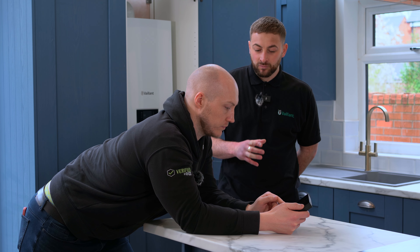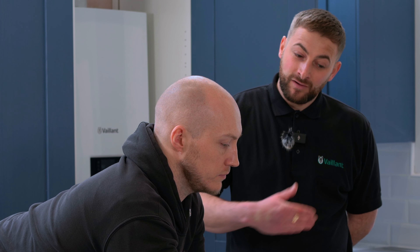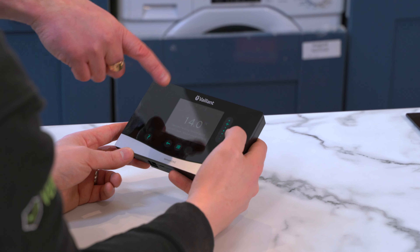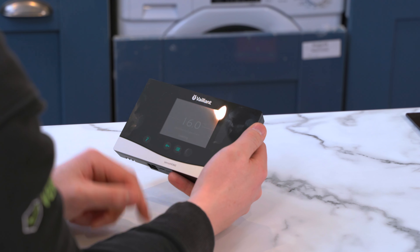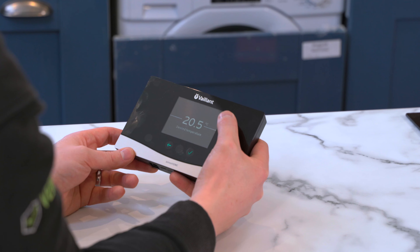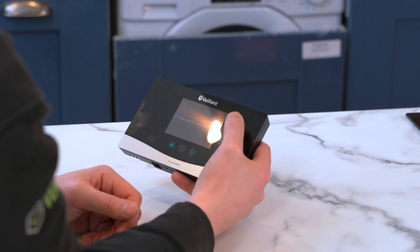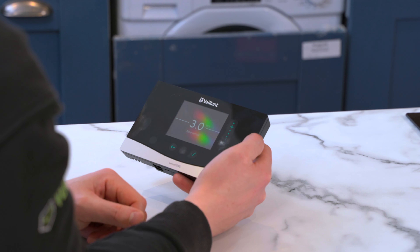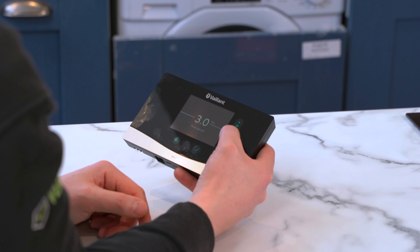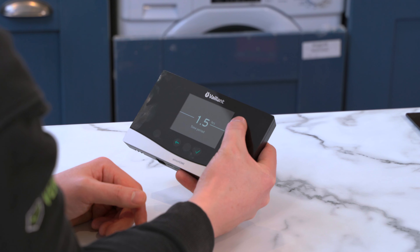The other thing is that you don't always need to go into that menu to make a change. Let's say your routine had changed and you decided you wanted to pop the heating on for an hour. If you come back to the very first display you'll notice that the slider is actually illuminated. You can quickly override it to either turn it up or down — turning the heating on or off within those time periods. You can choose that for the next few hours or permanently valid for all time periods. So that's going to override everything. You can do it for half an hour as a minimum or all the way up to 12 hours as a maximum.